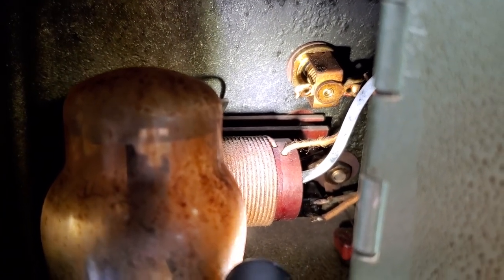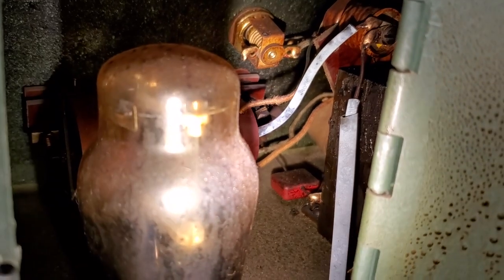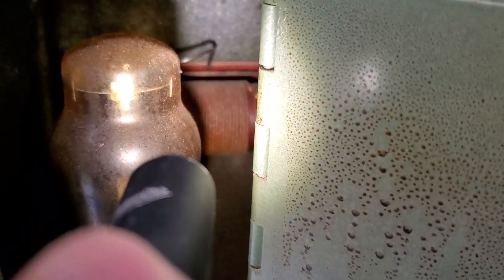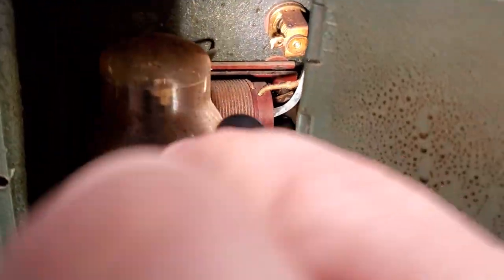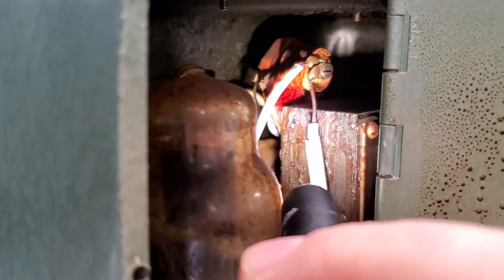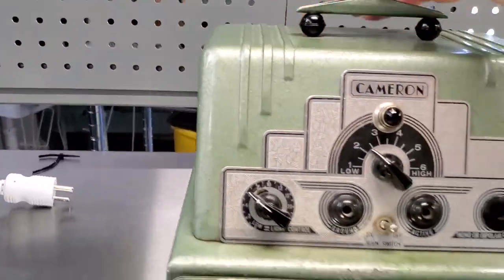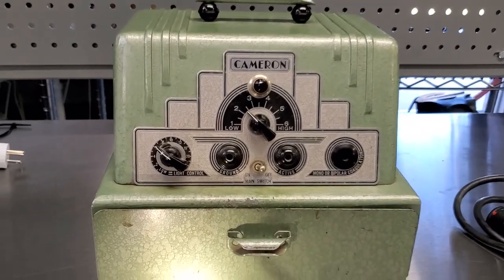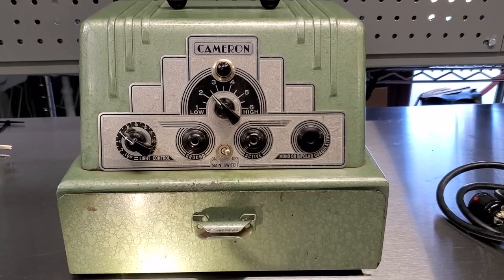You can see how you adjusted the power output — the wiper would go across that coil, and as it went across the coil it would hit more and more power. A rheostat is kind of like a voltage divider, and you can think of it like a giant resistor. What the wiper arm is doing is basically shortening or lengthening the resistor. What a fantastic piece of technology. Of course this should never ever be plugged in again — it's probably a fire waiting to happen. But as a museum piece and a historic piece for the family, since they're still very active in the medical industry, this being in the front is so amazing. This Cameron ESU is a piece of medical history.